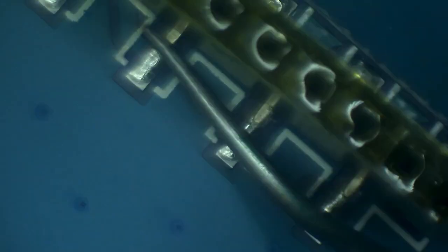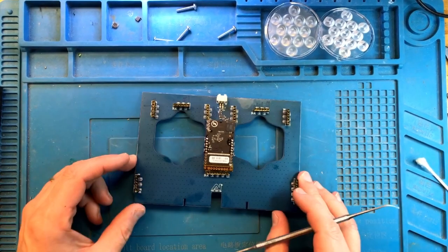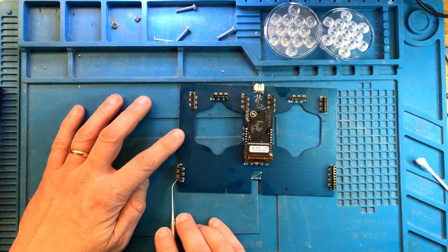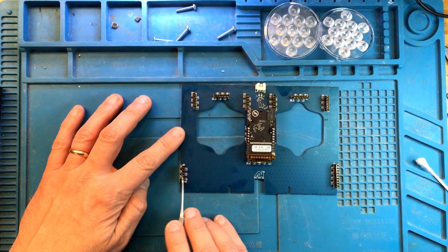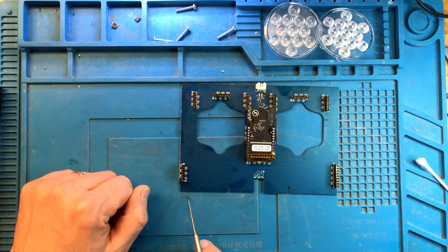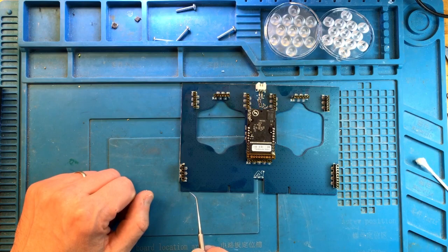And there will be no connectivity. And this is exactly why the blue channel was not running at full intensity and barely working. Because there was still barely connection from the pad to the pin, and therefore to the board that runs the LEDs. So it couldn't run a whole lot of current to run those LEDs. If I press it hard enough, the LEDs would work. If I pull it away, the blue channel will stop working.